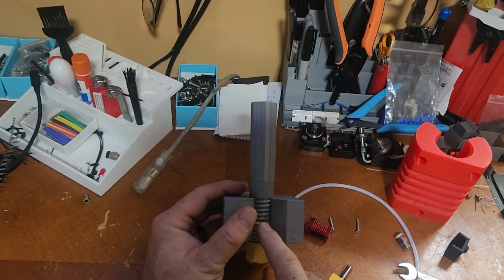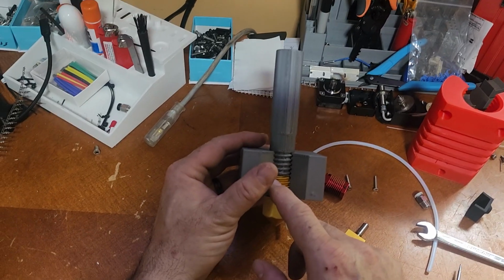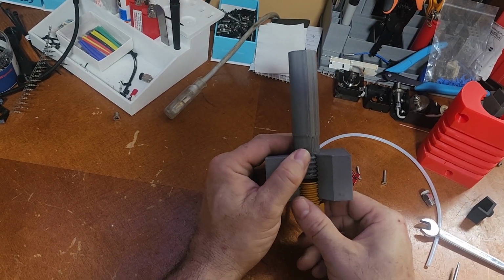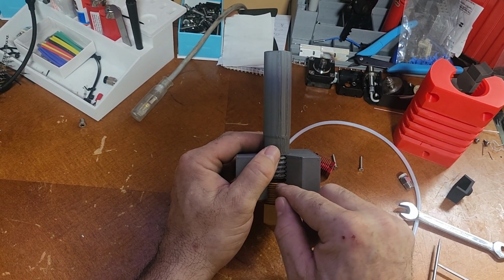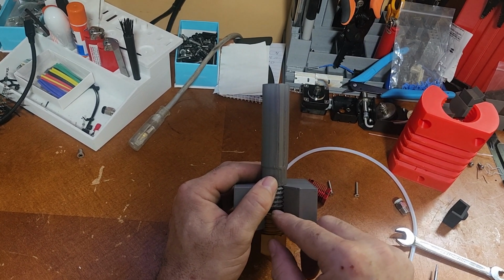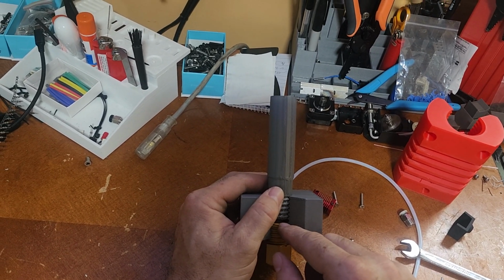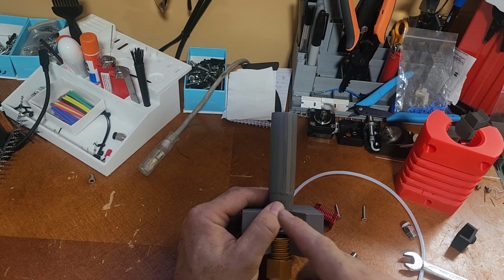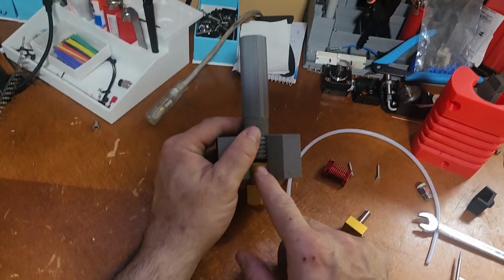Now there's no place for the plastic to get out and start to form a blockage, which is a common problem known as a throat block. It'll form a gap right here and fill this gap in. What tends to happen is this will get cool and solidify and start to make a donut. The filament will go through for a while. You'll start to see under extrusion first, until, just like a clogged artery, it fills in, and then your plastic can't get through anymore. It solidifies completely, your extruder starts clicking, and you're no longer printing because you're completely blocked up. The block is usually right here.